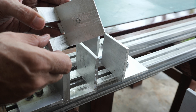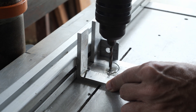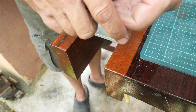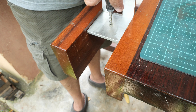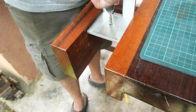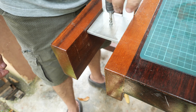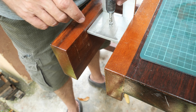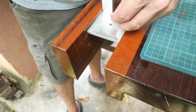Let's go for it. I'm using a spiral bit which is suitable for acrylic and soft metals like aluminum, so that the waste is expelled along the spiral path. Now I can test it.